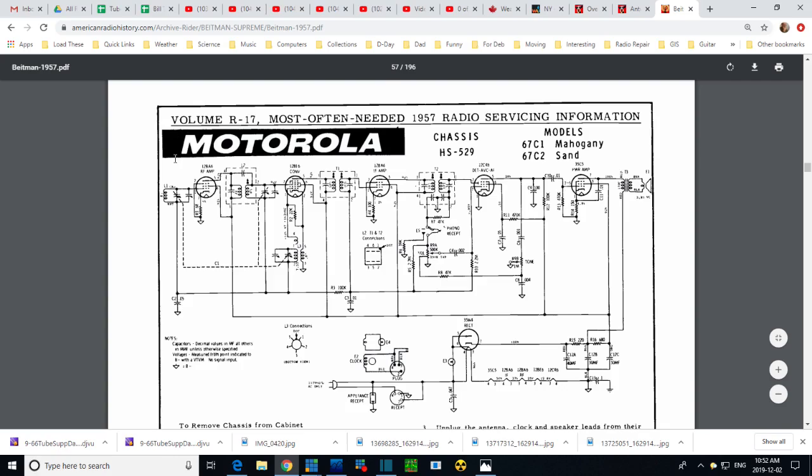The signal comes into the first RF amplifier — this is the tube I replaced, it was so weak. There's a cathode resistor here, and the grid through this coil is hooked up to the AVC line — we'll talk about that later. There's a DC voltage on here that needs to make it all the way to the grid through the antenna, which is why if you operate this radio without the antenna connected the grid won't be biased properly. The output of this is fed into a tuned coil with a capacitor, and comes out on the secondary.